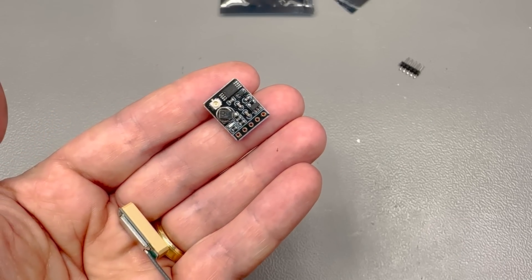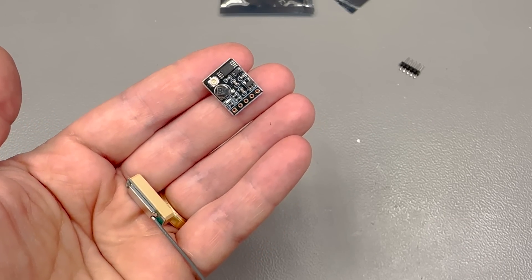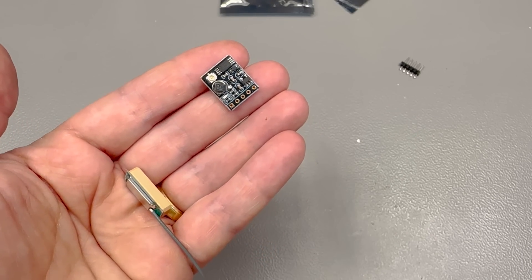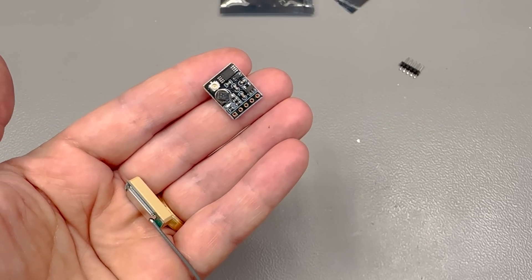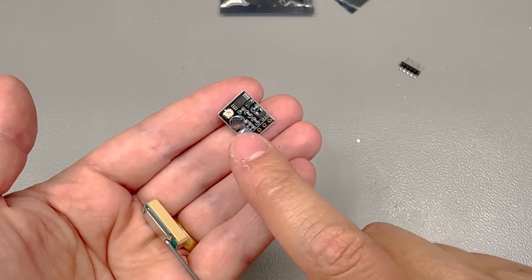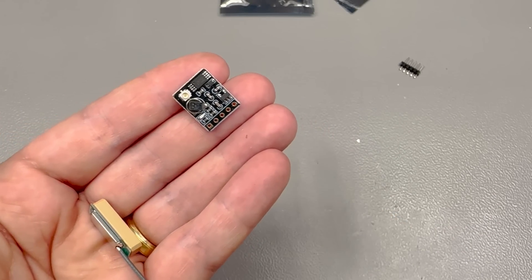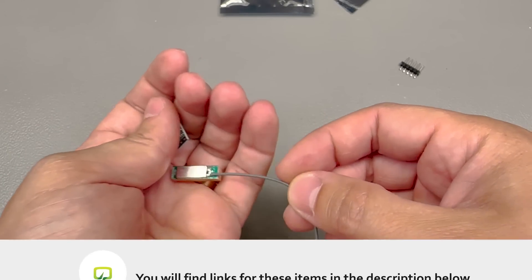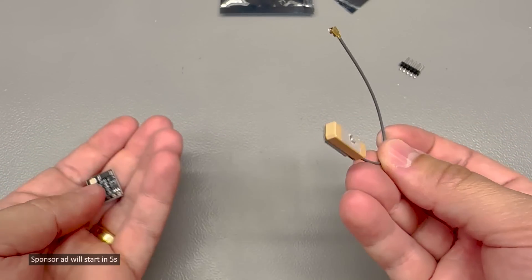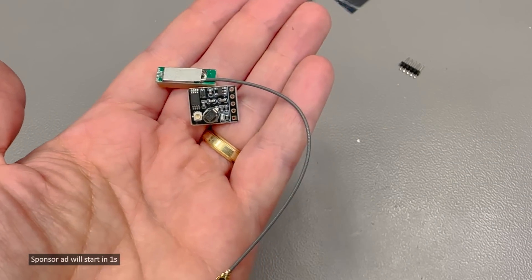Now obviously this is not the same deal — not the same performance, not the same low power usage — but pretty close, and certainly a good option for prototyping work and DIY projects. It's nice because it also includes the required voltage level translator chip, the LDO regulator, as well as the backup battery for the GPS in this small module. It's just the antenna that is an external unit, but since it's included in the package that doesn't really bother me. There will be a link to this in the description below.